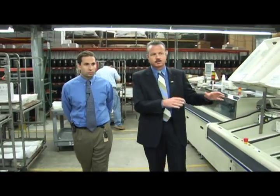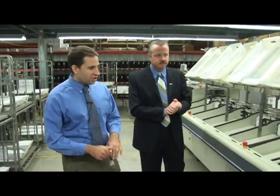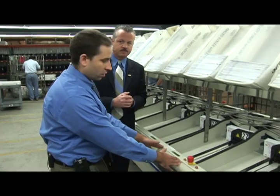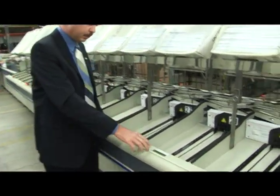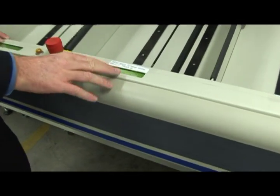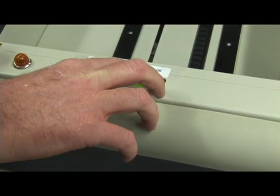These are live ballots that just ran out of the election. The machine is reading the barcode on the ballot, and the database knows which precinct that ballot is in. What it does is it goes to a pocket that has a range of precincts. If you look right here, you'll see that this pocket, for example pocket 29, has a range of precincts from 63-910 to 68-106, so it knows to go to that pocket.